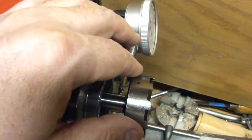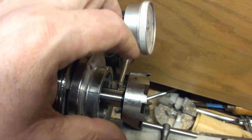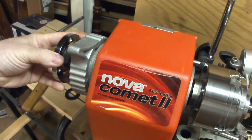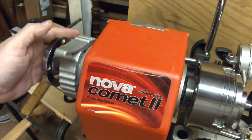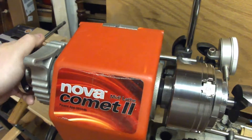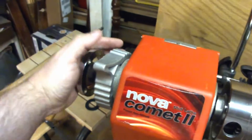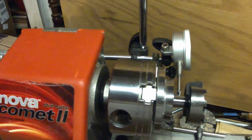The little dot up here is just a visual indicator for me that this mark here is pretty close to lined up. Then I rotate this back by hand, and probably even doing that introduces some amount of runout. On these lathes — they're wood lathes — they're not designed or manufactured for the type of precision of a metal lathe. Sometimes you can simply touch or wiggle this and it can move the needle up here. So it is what it is.